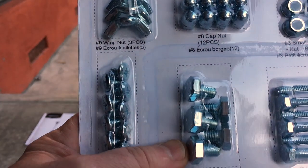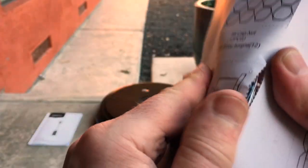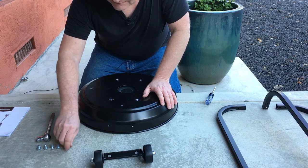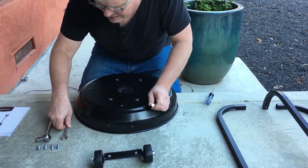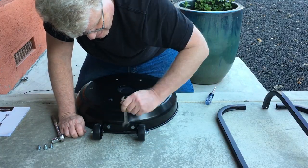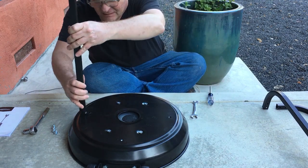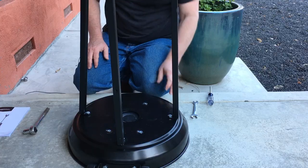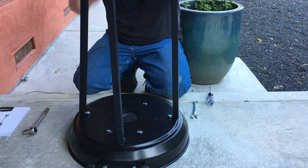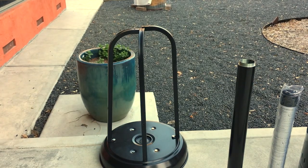Now we're going to go to our handy-dandy hardware pack and take out the five small bolts — use two to put the wheels on and three to put the hoop parts on. Just look at the back of this thing — it's beautiful. You just pop out the back for each item, they're all labeled, and you get what you need. I'm going to use my own wrenches instead of the goofy ones in the hardware pack. These bolts have a metric 14 drive, and a 9/16s would probably work too. Now I'm going to set the hoop pieces, keeping them a little loosey-goosey until everything's aligned. You can already see the tank's going to slide in here, and I bet these are for the chain to hold the tank in — there's one on each piece so it doesn't matter what position they go in.